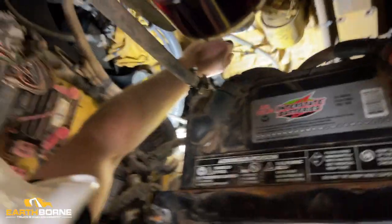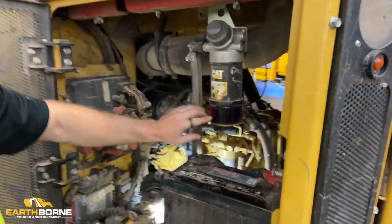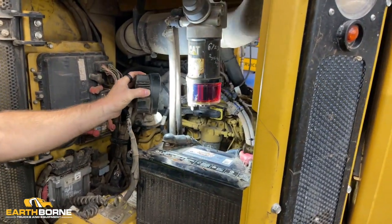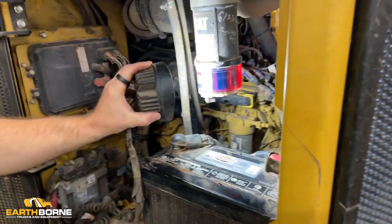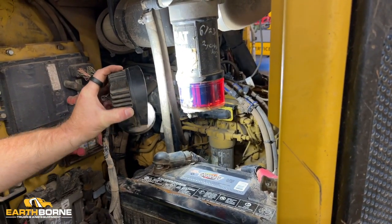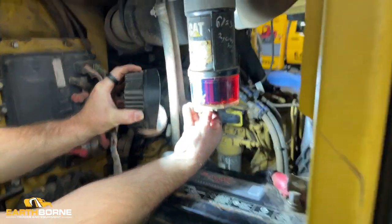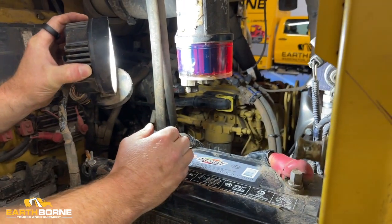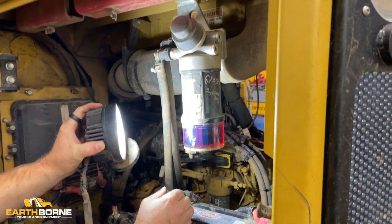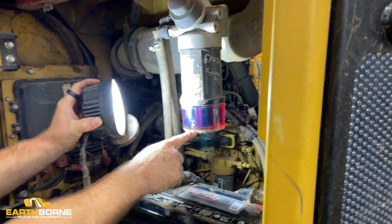One thing that we didn't mention on the Cummins is the fuel water separator. The Caterpillar has got a glass bowl right here. And as you look into that glass bowl, you can see that that is nice red off-road fuel. There aren't any indication of any water or any debris in there. If there were, you would turn this valve at the bottom, let the water drain out, and then you'd go into the cab and you'd turn the key to run and you'd let the fuel pump pump up fuel back into the filter, and you want to make sure it's filled up before you actually start it